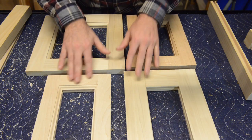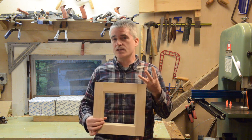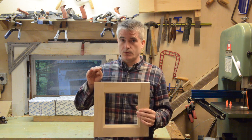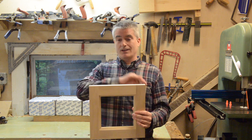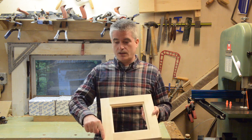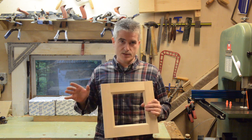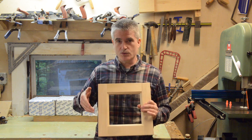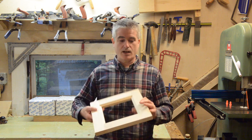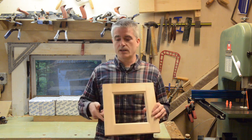One of the things I noticed about using this set is I kept discovering new and interesting ways I could use it. There are three really interesting characteristics I didn't get to try out and demonstrate, but I want to mention them quickly. First, this set is entirely compatible with machining arch top doors — it's a six-inch diameter tooling set so you'll want to make sure the radius is compatible, but it works just fine. Also, we haven't spoken about machining the outside of the doors. Tooling can be had from Whitehill that works perfectly with the zero set principle — you can machine all the components as you normally would, assemble them, then install a cutter block on the shaper without having to adjust the spindle height or fence settings to machine the profile on the outside of the door.